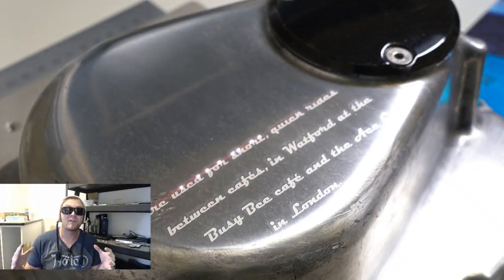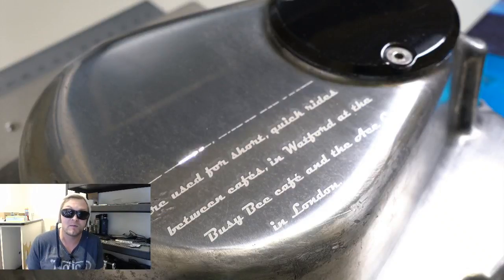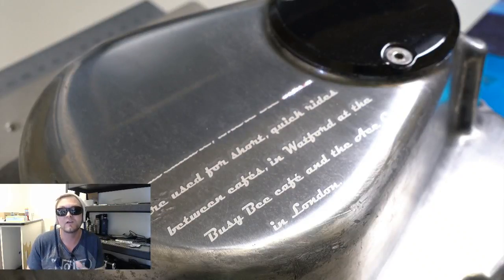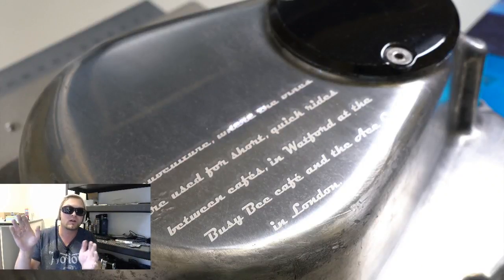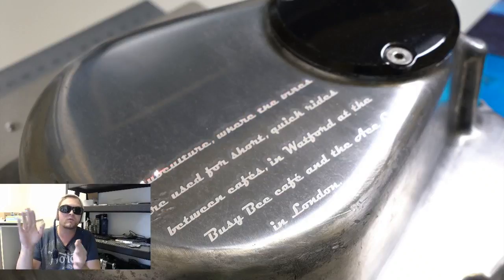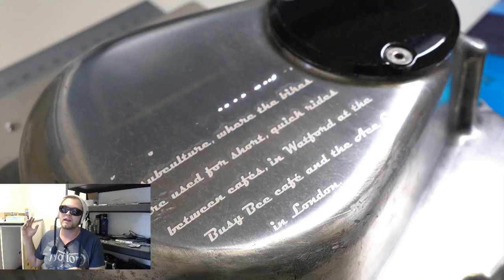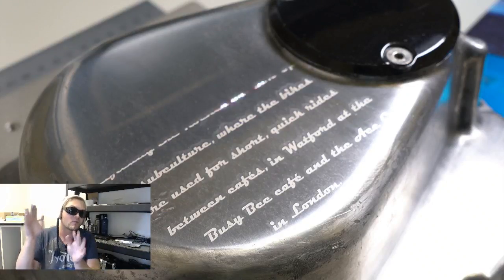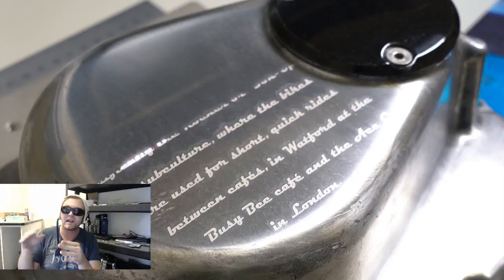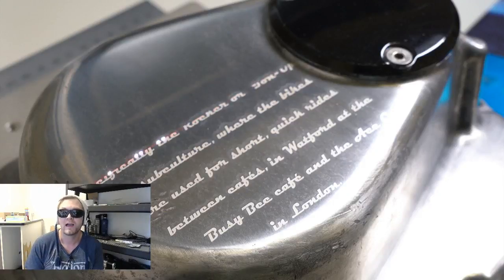As you can see, the galvo laser is awesome — you can do metals and it's extremely fast. The reason it's so fast is because galvo means galvo mirrors, and those little mirrors are motorized. Your laser travels through the fiber optics, bounces off the motorized mirrors that are just flapping and creating the output. No gantry — that's why it's so fast.